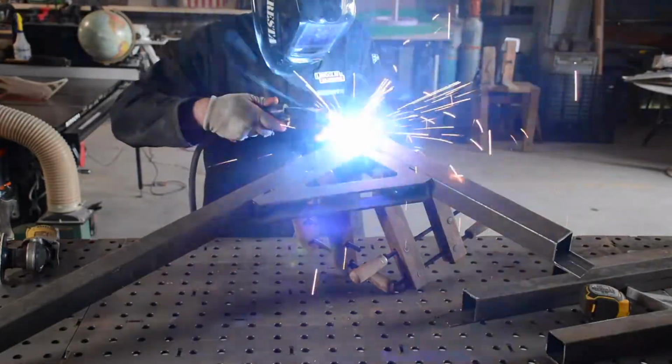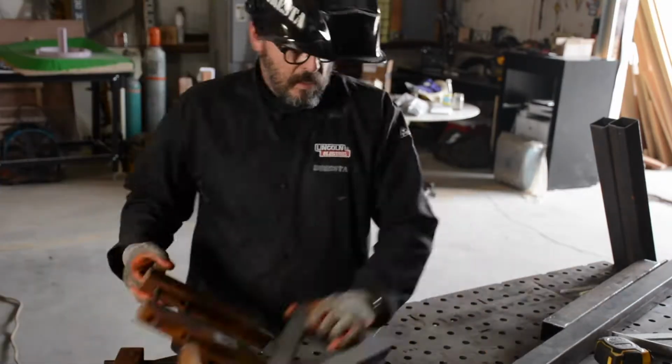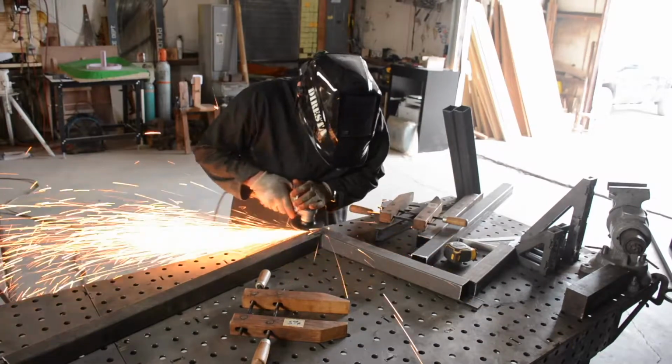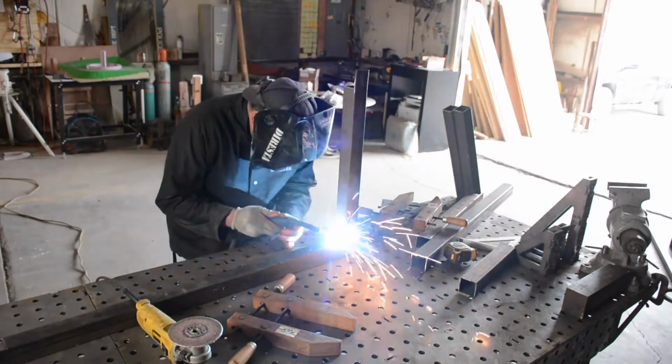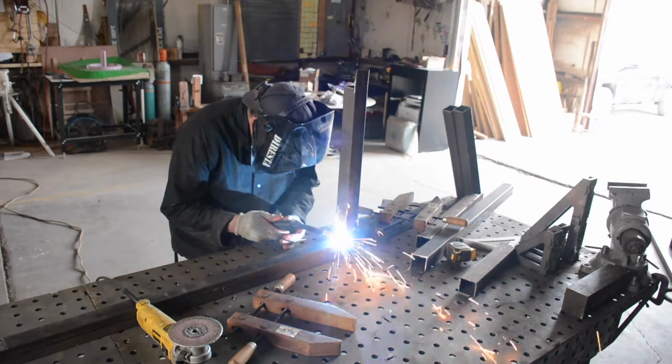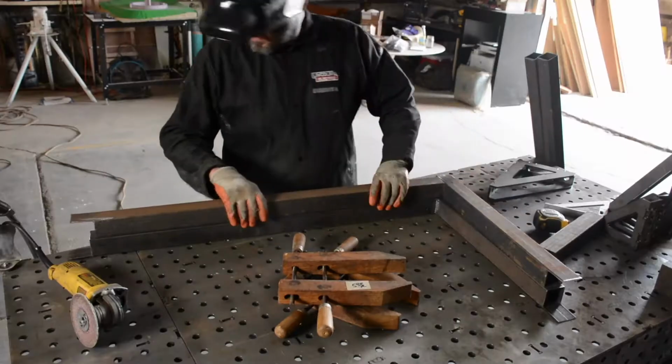And using the MP210. And it's a little difficult to weld this. You got to make sure you set it the right gauge so you don't blow through. And if you do blow through, I sort of have this technique where I call it the scribble weld, where I just keep scribbling over the open hole and eventually it starts to fill in.